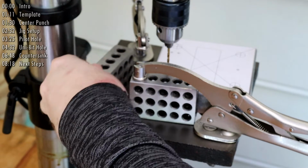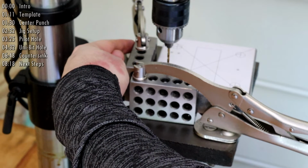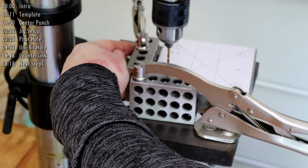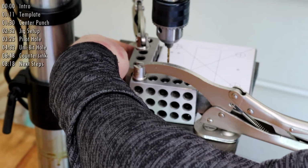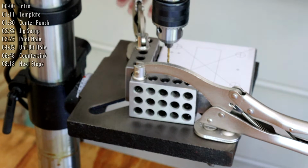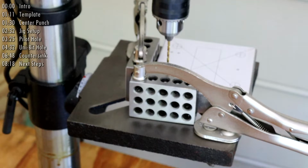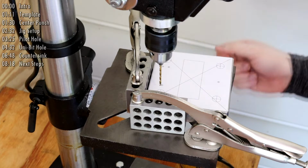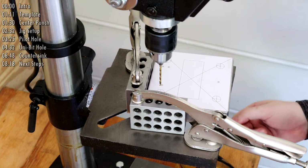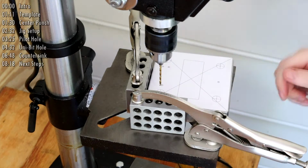The second block added creates a corner that I can set each enclosure into. Now I can make the pilot hole and repeat that process for each enclosure. Don't forget about proper drill press safety: eyewear, hearing protection, and no articles of loose clothing.